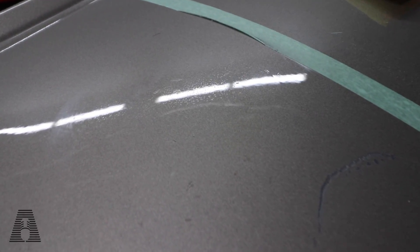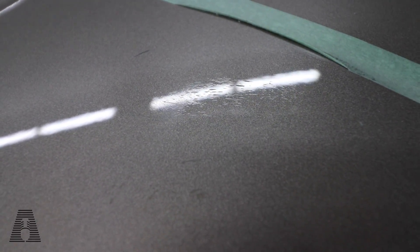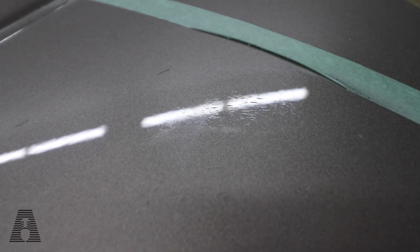Another warning sign. With an entry-level rotary polisher like this Max Shine, you're going to have a ton of warning signs before you actually burn through the paint. Those are blisters — just like a sunburn. Essentially, the paint has a sunburn right now from all the heat, no different than being out at the beach too long. Huge warning signs. The problem is those are not correctable now — this would need to be repainted. You've essentially started the process of burning the paint.